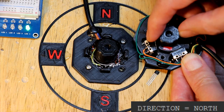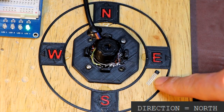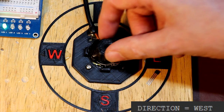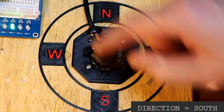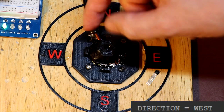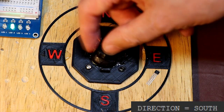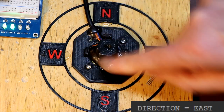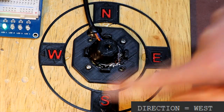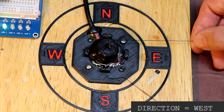I've simply replaced our mechanical clickety-clack switches here with 4 Hall effect transistors, and rather than a cam acting on the switches, I've glued a number of little magnets onto the cam here, so as soon as the magnetic cam becomes close to any of the transistors, it switches it on. And because the cam no longer makes any physical contact with the switches, we've got no friction, no wear, and we can move an awful lot faster if we wanted to.